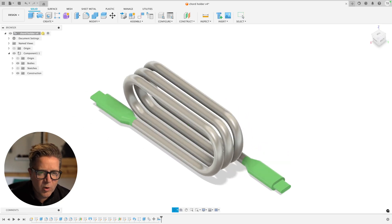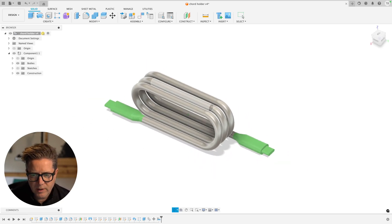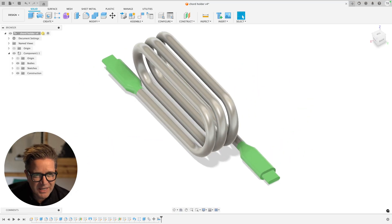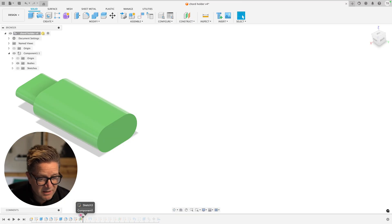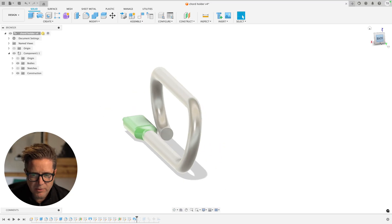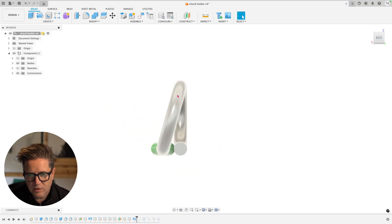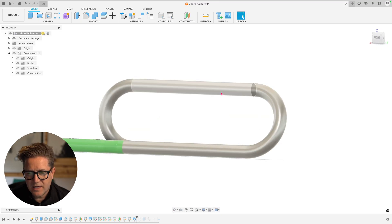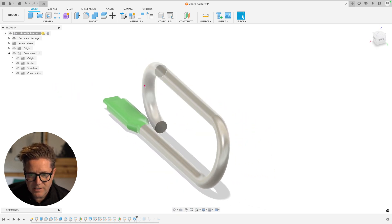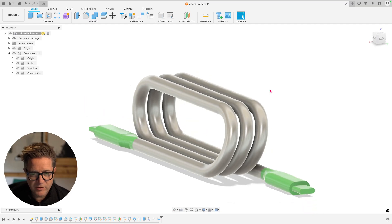I'm working on a new cord organizer to 3D print and was modeling a USB-C cord. It's a little tricky at the base — I need a loft to solve it. For the cord itself it gets really complicated: I want it to come over at an angle then drop down vertically. It's not a consistent coil but has a flat run, so this is a custom sweep requiring a series of paths where 3D sketching can be especially helpful.